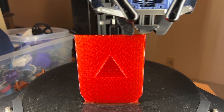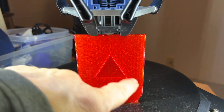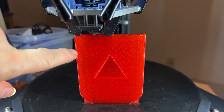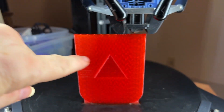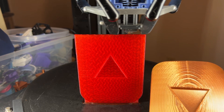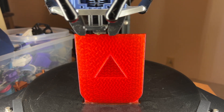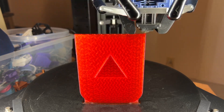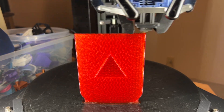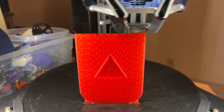Reasons to print this guy vertically: it's pretty fast, it optimizes what's going on in the center in terms of getting a clean result without any kind of support, and it optimizes the finish on this face because the printer moves very smoothly in the XY plane with great precision — as opposed to printing it flat where you'd get that tree ring stepping effect. If this disjointed approach to teaching the basics of 3D printing appeals to you, please like and subscribe. Thank you folks for your time, have a great New Year's Day, and we'll be back with more 3D printing tips.